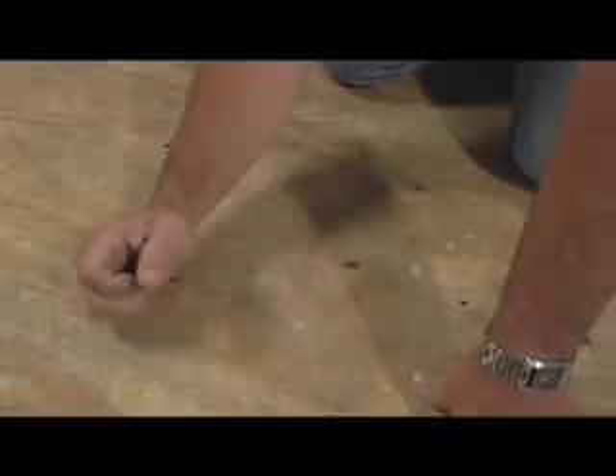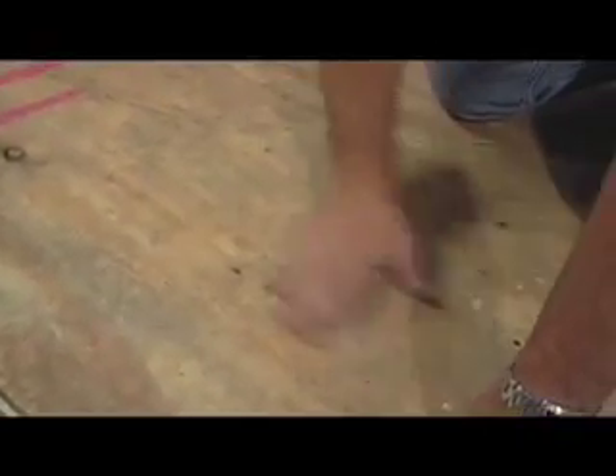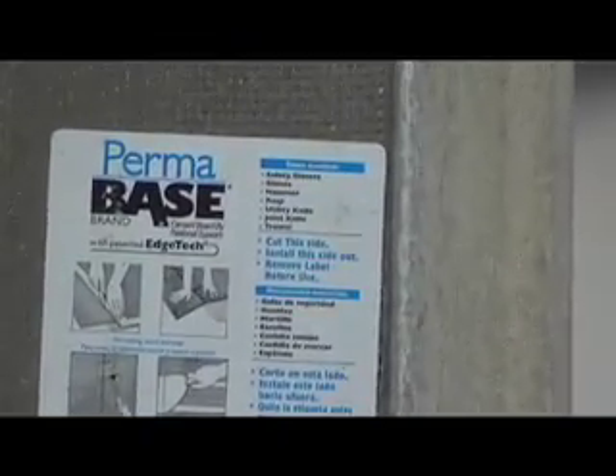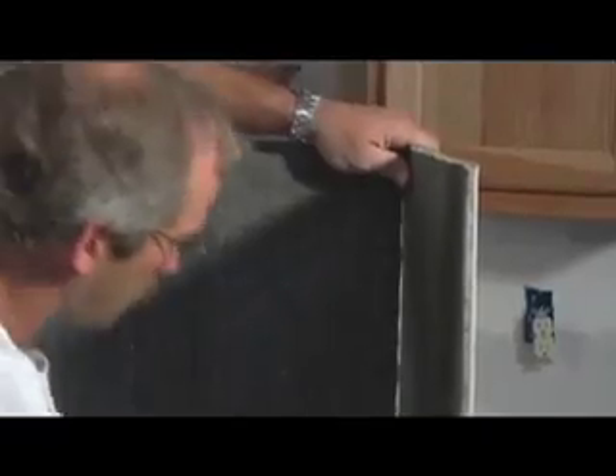For this kitchen project, we'll start by prepping the subfloor. It's a really bad idea to lay tile directly on the plywood, as plywood will flex quite a bit. Preparing the subfloor for tile is very important. This starts with having a layer of cement board, which prevents flexing and creates a strong water-resistant base for laying the tile.